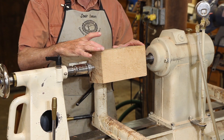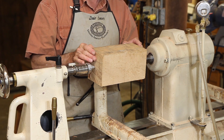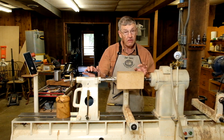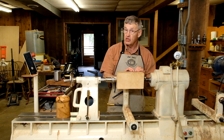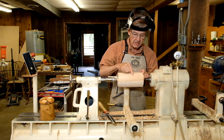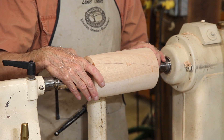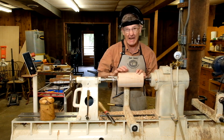We're going to start with a 5 inch square by 9 inch long block of wood. This one actually is 4 and 7 eighths, which is exactly the base diameter of the one that I turned a few years ago for my wife. This one may well come out a 16th or so under that — I won't tell if you don't. Our first job is just to turn this round. I've gotten a nice cylinder. I have a slight check in this piece but I've put super glue in that. It's hard to get a piece of wood this big that you don't have a check in. Good reason to turn this from green wood, which will be easier. It'll warp a little bit, but that'll actually make the lid fit better because you can turn it a little bit and it'll lock.